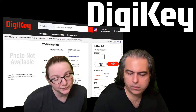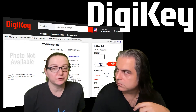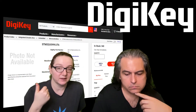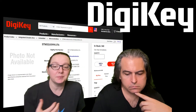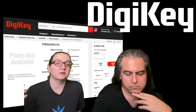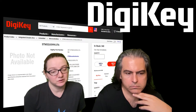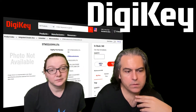Question: when referring to a crypto chip, is it for Wi-Fi or the code itself? The crypto hardware is often used for chip security. If you have data sent over IoT using bare SSL, a crypto engine will help speed that up. Alternatively, if you have data on an external flash chip that you want to decrypt on the fly, that's another situation where crypto hardware support is very useful.